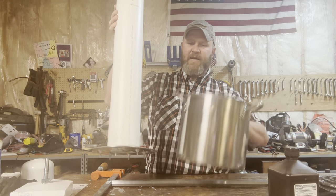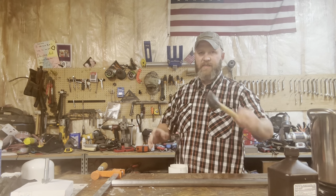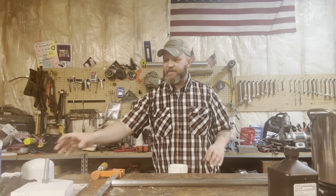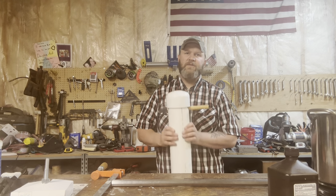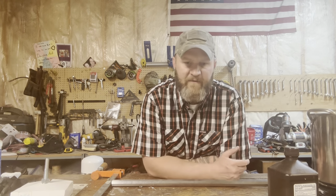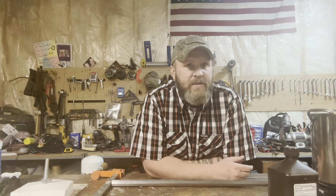We're gonna heat that water till it starts steaming, and then we'll be able to lower the barrel down into this, and basically it'll go down in there. That steam will sit for about 45 minutes. We'll cap this off, just like that. And that should convert the red oxide that we got from the hydrogen peroxide into the black oxide. Then we're going to card it off.